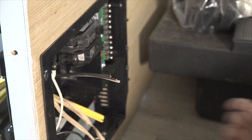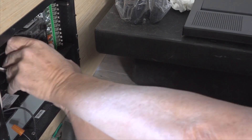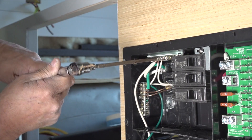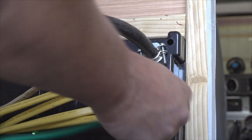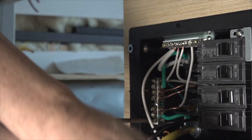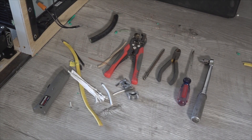Route all the branch circuits the same way and make the hot, neutral, and ground connections the same way. Now route an 8 gauge or larger green or bare wire through the hole next to the ground bar and connect it to the negative post. The opposite end goes to the vehicle chassis ground. All the ground connections are extremely important, so make sure you use the proper gauge wire and that the connections are secure. Here's an RV 101 pro tip: make sure you label the breakers and the fuses in the proper order for future reference. It's important you follow the torque specifications in the instructions. If the screws are too loose you can have a poor connection, and if they're over-tightened it can damage or break wires. Torque the screws to the proper torque in inch pounds.